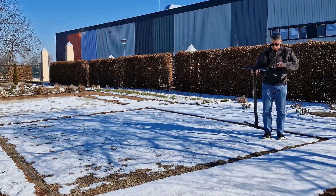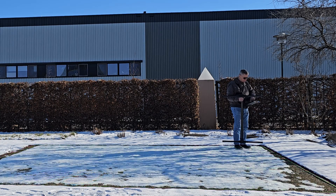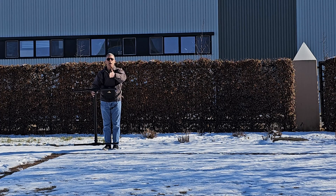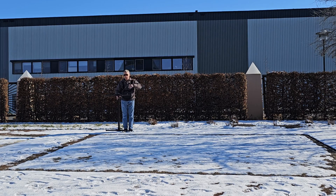So now I have two scans. I want to save those scans with the exact same dimensions. Now comes the third scan. I'm going to go exactly 90 degrees to the first two, because if my target is in the scan, I want to see it once, twice, and then go 90 degrees to it and see it again.